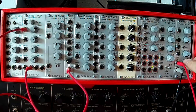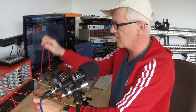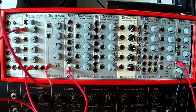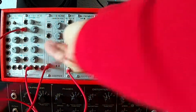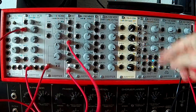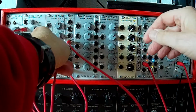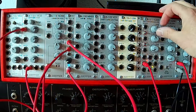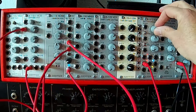This sample and hold thing needs some sort of trigger. The first trigger will be this random output of the noise — it's producing all sorts of frequencies randomly — and I put it into the sample hold trigger input. Then secondly, from our LFO, the A147 you already know, I take a square wave into the triggering of this thing. And immediately you get this sound, and when I use the LFO speed here I can speed it up.